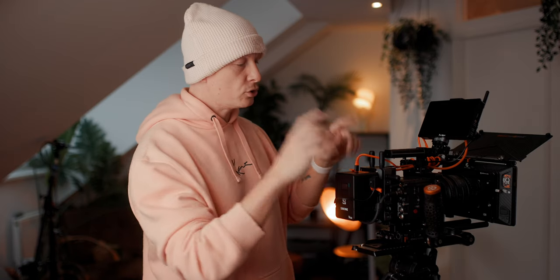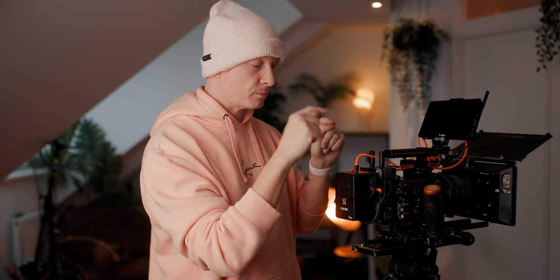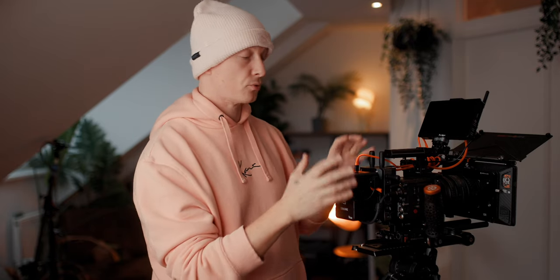Tiny warning: you need to turn on the transmitter and wait until it is fully turned on, because before you do this, there is no pass-through to the camera. So make sure to have this powered on before you plug in your SDI ports because of the SDI protocol.